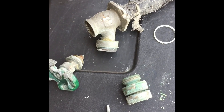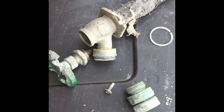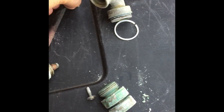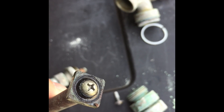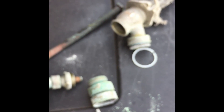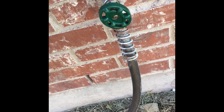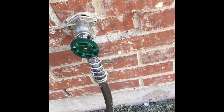Here's the old hydrant — I just call it a water faucet, but it's called a hydrant. If you want to save some money, you could probably take that washer right there at the end of that screw, replace that rubber, and work on replacing some of this. But for 30 bucks it's easy enough just to put in a new one. It's been about 2 hours since I did the repair, and it's all dry over here, so it looks to have been successful.